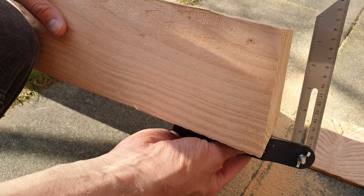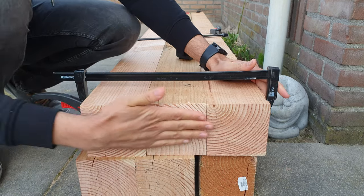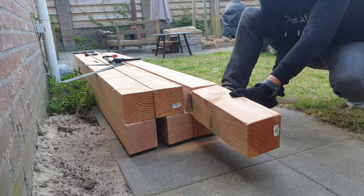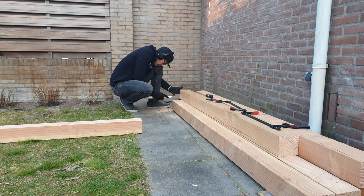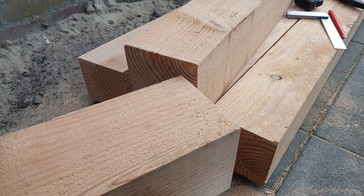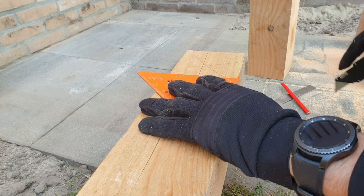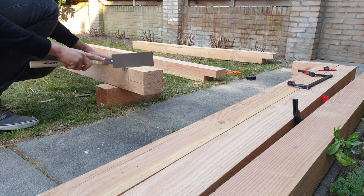First let's get started on the top of those back posts. With the angle cut on the top of the back posts I'm cutting the fronts to length. I'm doing this because these have a specific height I want them to be. The back will be cut to length once I can measure how tall it exactly needs to be. Now that the posts are cut to length I'm marking out the half lap joints that will hold the upper beam and make the cut out from the posts. I'm using this construction mostly for aesthetics. I really like the look of those thick beams.